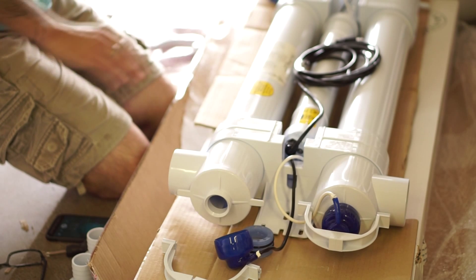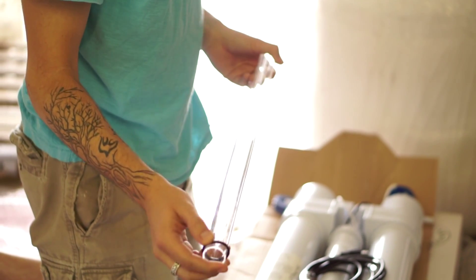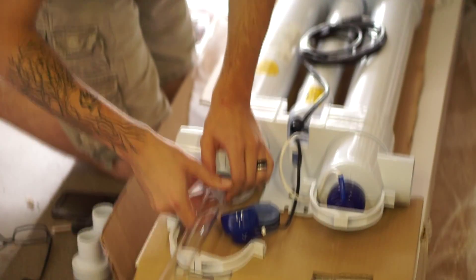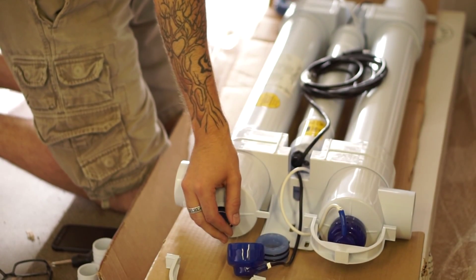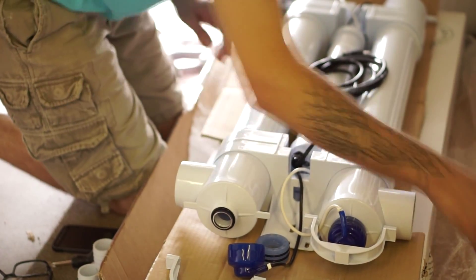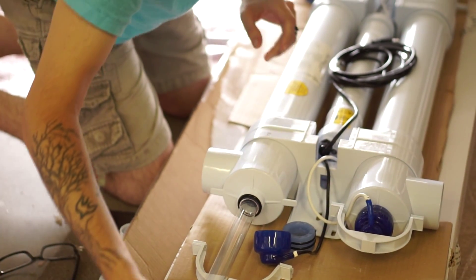Now that you have your quartz sleeve out, it's time to replace it. You want to check it for any buildup — a clean quartz sleeve is always recommended. Then you want to put your two O-rings on and slip it back in. When you slip your quartz sleeve in, it's going to go in one side and you'll be able to see it come out the other side. That's important, and it should sit nice and snug with your O-ring. Get your quartz sleeve in, and then replace your bulb doing the same thing in reverse, making sure you do not touch the bulb as much as possible. You can even wipe it down during the process of putting it back in.